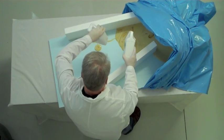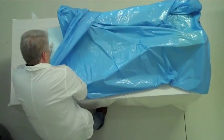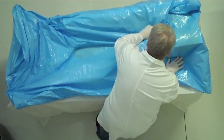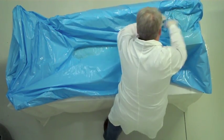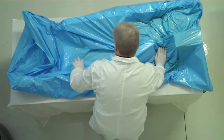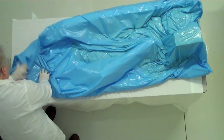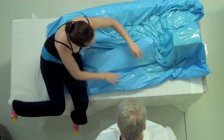Remember, you have two sets of foaming agents to make this form. Now, you're ready to pull the bag down over the rest of the form. Pull the bag all the way down and start to push the bag on top of the foam. Push it down over the headrest, the armrest, and all other areas where foam is touching the form. Try to get as much air out of the bag as possible. When you're done, pull the ends of the bag down and fold the end of the bag underneath the form so no foam will spill out.